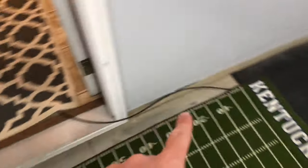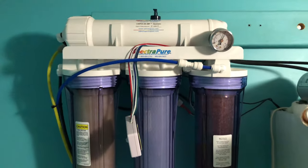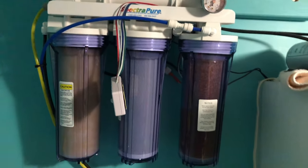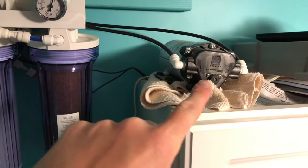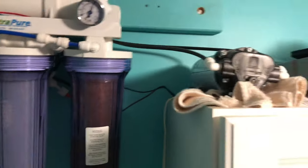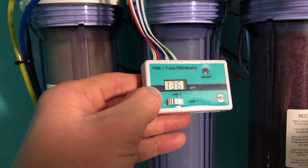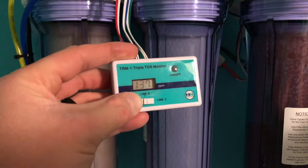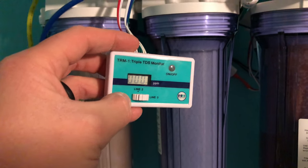As you can see, I've got the RO line right here — probably 30 feet of RO line. It runs into the laundry room, comes up, and connects all the way up to the SpectraPure CSP DI 90 gallons manual flush. Manual flush means if I'm going to flush, I have to turn this valve right here; it'll kick the booster pump off and the flow will go down significantly. As you can hear, the booster pump's running. My input TDS is 136-137. Line two is 000 and line out is 000, which is perfect.